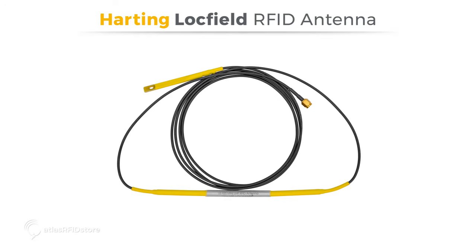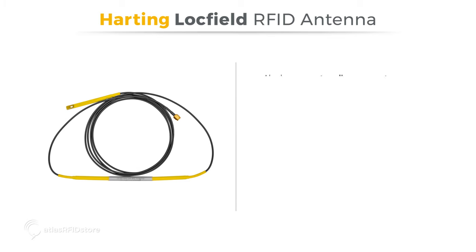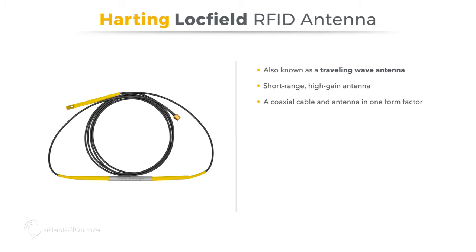The next antenna we have is a Harting Locfield antenna. This is a very unique type of antenna known as a traveling wave antenna. It's called this because the RF waves travel along the length of the coaxial cable toward the two ends. The Harting Locfield antenna is a short range, high gain antenna that is very convenient because it's a coaxial cable and an antenna in one form factor. This means it can be directly connected to an RFID reader. The Harting Locfield antenna has a diameter of only a few millimeters, but because of its unique shape, it can read tags in most orientations, similar to a circularly polarized antenna.